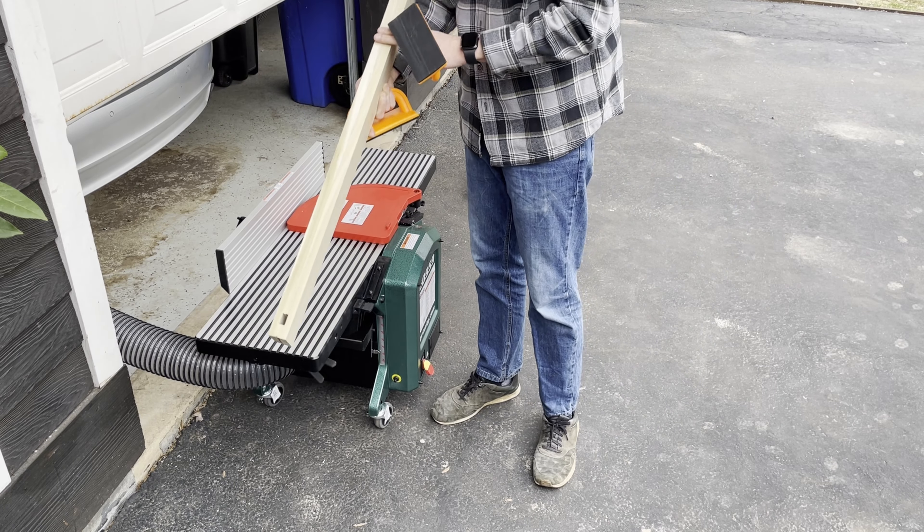This is a two-inch piece, just showing you that after some practice I was able to get a good joint on both faces, and then I ran it through the table saw. Putting it up against my level here to show how flat it is — holding it in the middle so it's showing off a little on the edges, but it was nice and flat. Those are burn marks from the table saw. This was plenty sufficient if you wanted to joint two or more boards together. I'm going to check how square it is — for the product and what you're getting out of it, this is plenty sufficient.